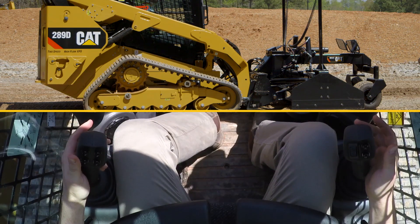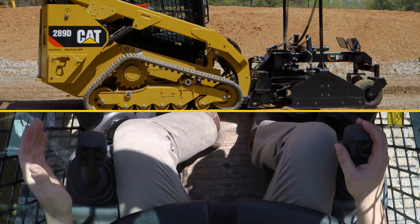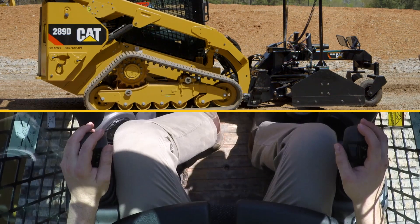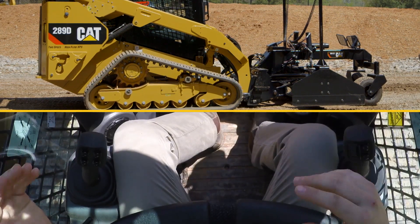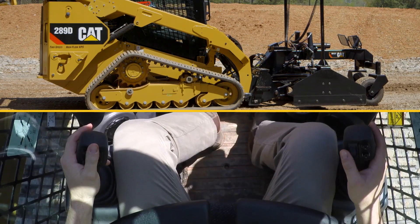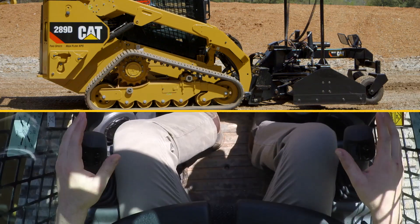This tool can be controlled either automatically or manually. In automatic mode, you simply pull the left hand joystick trigger to enter, and it will automatically control the position of the blade to achieve the targeted grade. In this case the setup is dual laser, so I have a transmitter on the other side of the field creating a plane in space. The receivers then communicate with that transmitter and tell the blade where it needs to move to achieve the material spread to the grade target.